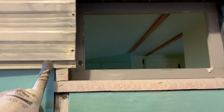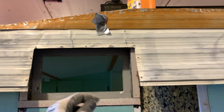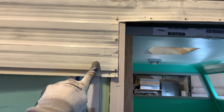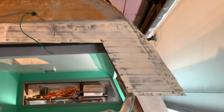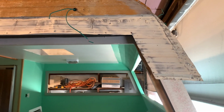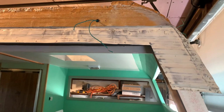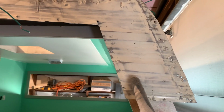Here's where you start getting into problems. You got this window, it's overhanging this way. So it's like, oh yeah, that's simple. Just move the aluminum back, right? Just move this whole panel back. And then you come over here to this window and look where we're sitting. We're way back. So, sure, it is the framework being built incorrectly, right? That's the problem.